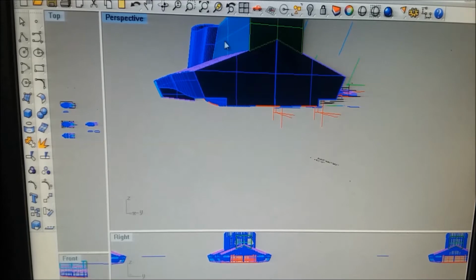That's the reason for these side enclosures around the engine. But sitting with nobody up here counterbalancing the weight, they would tend to not have much, especially a two-point one. But a three-point one can still have that problem, just not as much. So to solve that, this boat was made wider above where anything will be riding. If it's sitting at the dock, when it starts to tilt down, this part goes underwater and provides buoyancy. And it can tilt 7 or 8 degrees. But the water will never get up here because you see how much airspace. It's 3 times the weight of the boat. So it's not going to do any sinking.